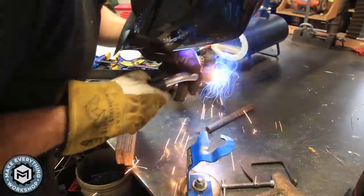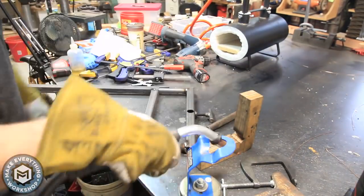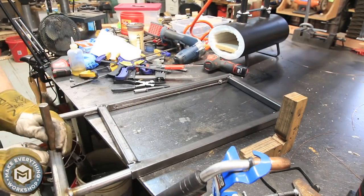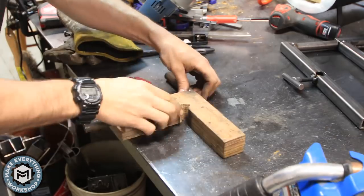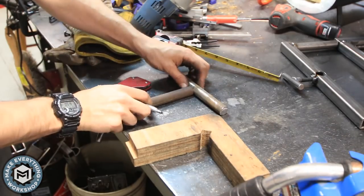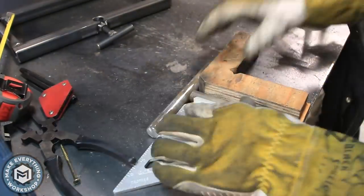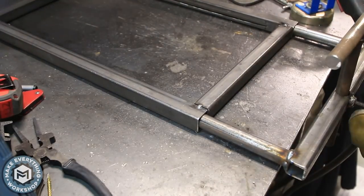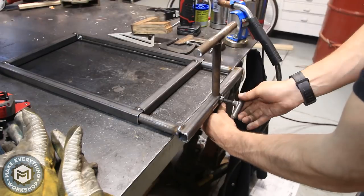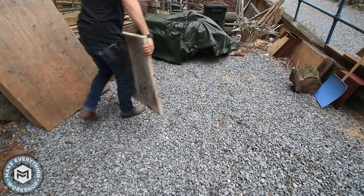Now that's all done, I'm finishing welding the frame and attaching the front of the drawer slide. It's kind of hard to find the right position so you use whatever you can. You can see how that tool rest can now be adjusted up and down. I'm using another piece of three-quarter inch round stock for the actual tool rest surface, spending extra time squaring it up, tacking it, and then fully welding it so it's nice and strong. I wanted round stock here to limit the surface area my material touches, so it doesn't act as a heat sink.